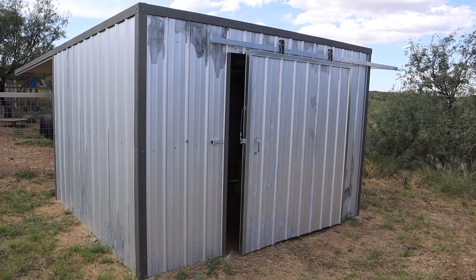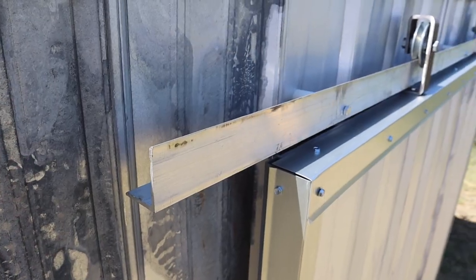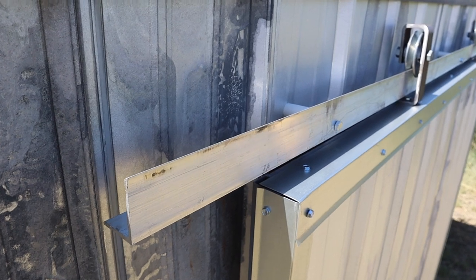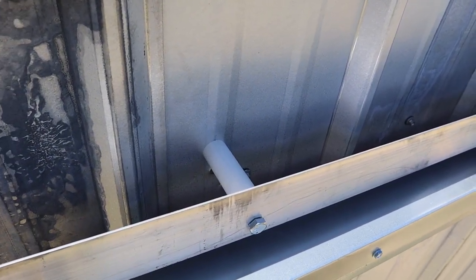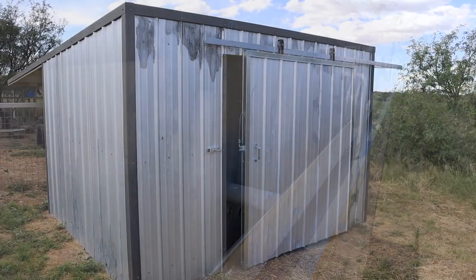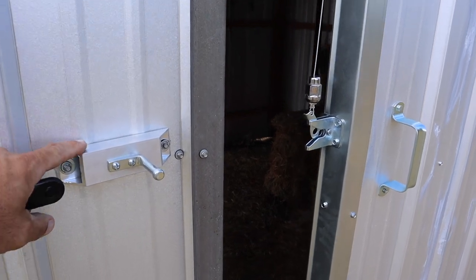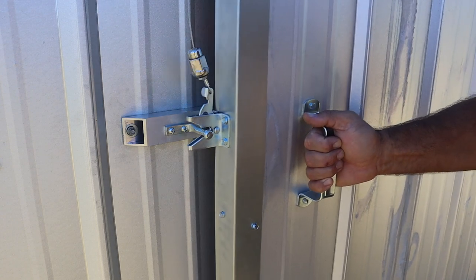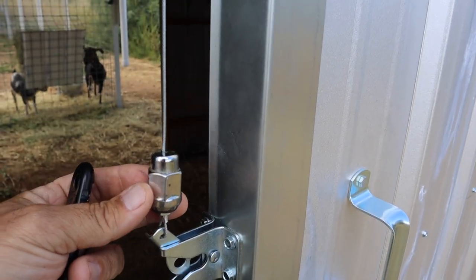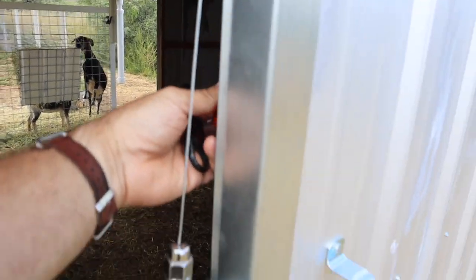The last clip you probably saw was me installing the roller hardware onto the barn door, and you can see it is installed now. You may be wondering about the track it's hanging off of — that is a piece of scrap aluminum angle I had on hand: 3/16-inch thick, by 2 inches tall, by an inch and a half wide. I have it spaced out from the barn by about two and a quarter inches to allow the roller hardware to pass by the corrugations of the sheet metal roofing I'm using as siding. The lock hardware is just standard gate hardware. I used a little scrap piece of aluminum as a spacer to bring the locking bar out to where it meets up with the edge of the door, and then I added a lug nut as a spacer to give a little weight to it.